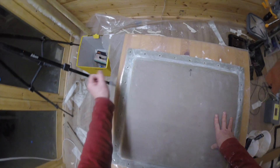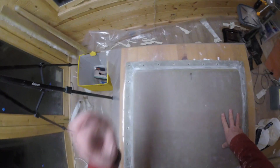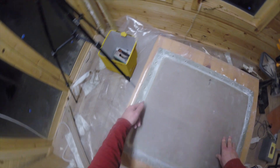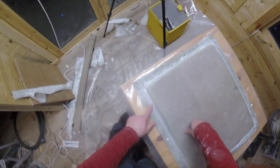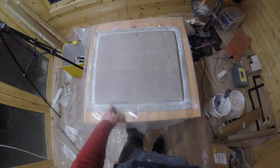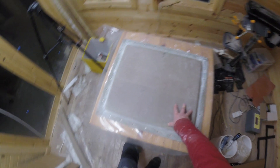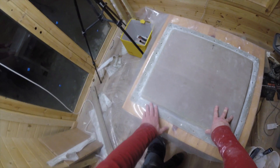As I was wetting it out I realized it wasn't really going around corners easily — it was quite rigid and wanted to spring back. As a result I got quite a few pockets or bubbles, particularly in the corners, which I've just sanded out. It's not a problem because that was really just for cosmetic purposes; it's just that outer layer that didn't really follow the contours.